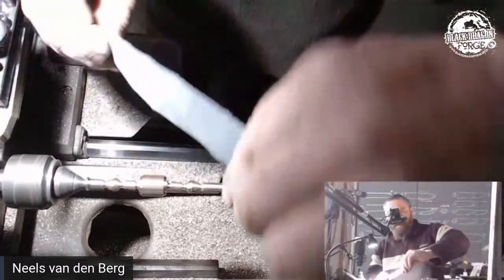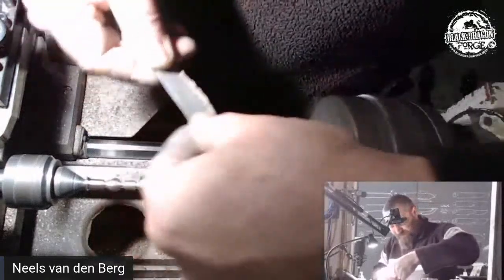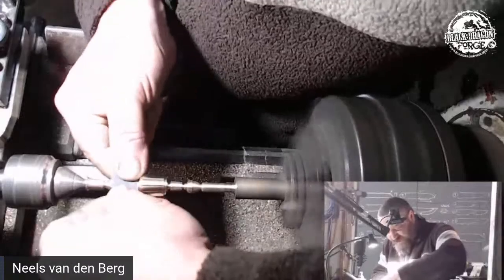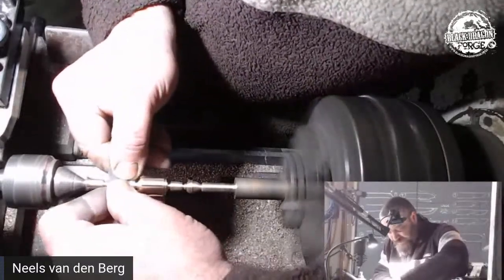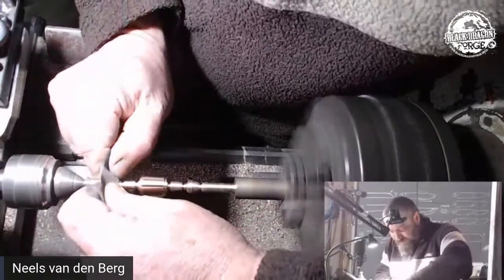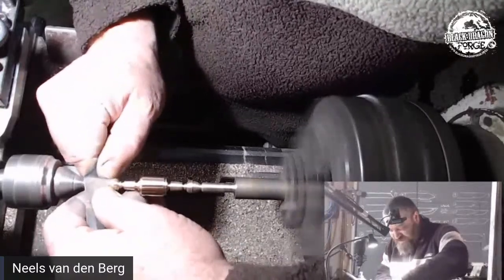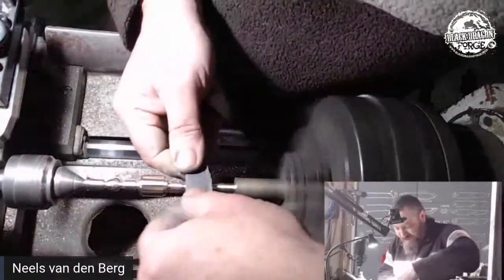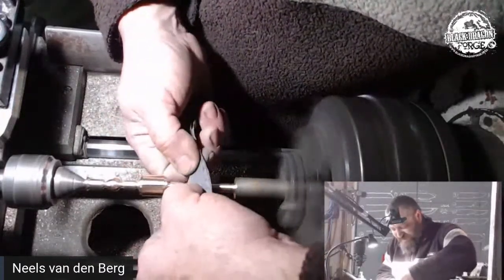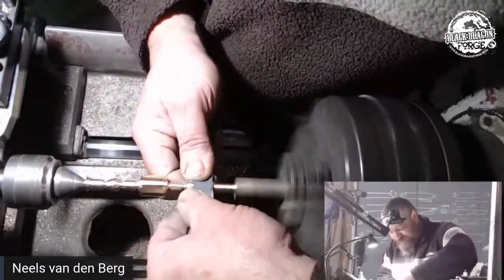Now, that torn away piece, this is the 600. Fold that in half, and now just with my hand pressure, so not a mechanical backing, I'm just letting the sandpaper form on this. Also I see a lot of guys going on about what's the best sandpaper to use. Yes, there are some real brands, but in working on bronze, it doesn't matter. You can use freaking wood sandpaper. It really honestly doesn't matter.